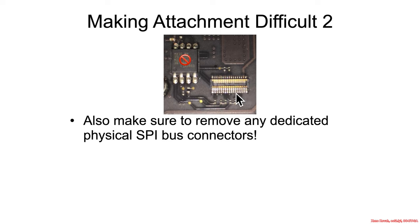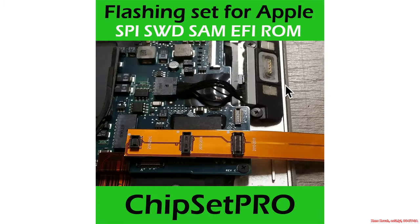This was from a Mac mini used in previous research. If you have exposed debug connector pads, that's going to be an easy, obvious target for an attacker. Even if you removed the connector, exposed traces would still potentially be a target — the traces have to actually be buried in the motherboard, which becomes more costly. If you leave that kind of debug connector on, you'll see tools for it show up on the Chinese market — easy ways of clipping onto the SPI flash connector, available for just $97.99.